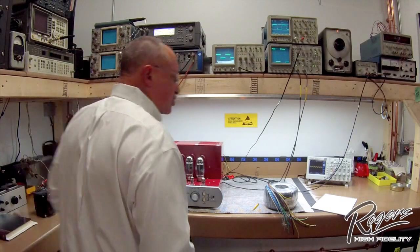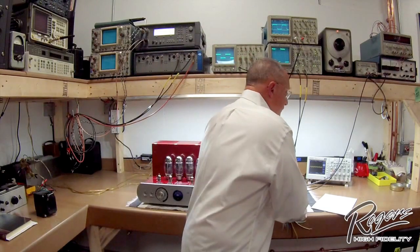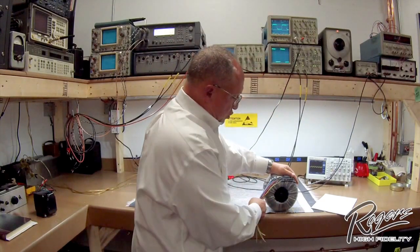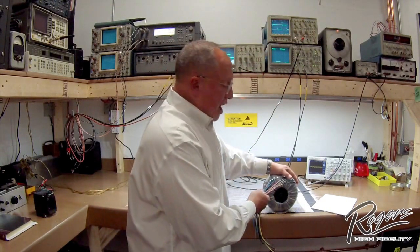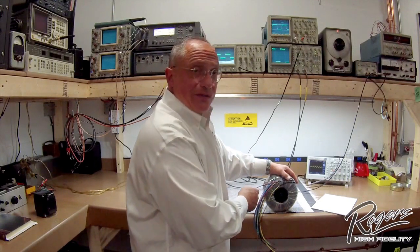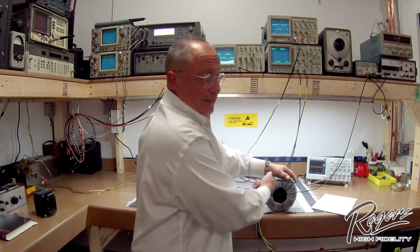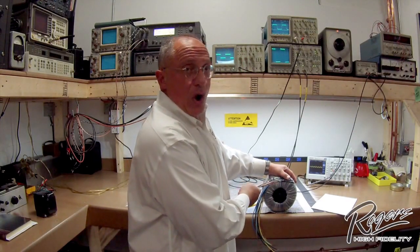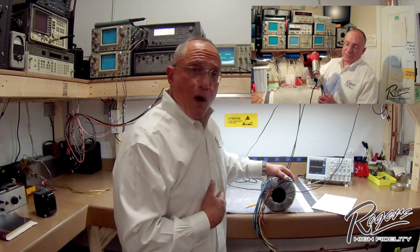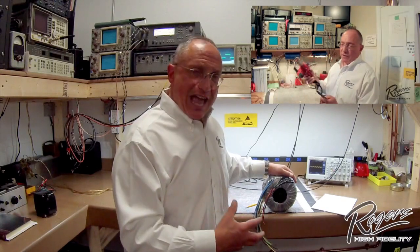It's a very special design — a broad bandwidth toroidal core transformer. Not only the weight and heft of this unit, but this transformer is wound with solid copper wire with silver plating, the same as all the wiring in our amplifier. We use military-standard wire for the transformer winding, and the wire leads exiting the transformer are Teflon coated. The reason we use Teflon wire is that it resists heat and aging — the two real enemies of class A amplifiers.